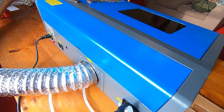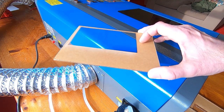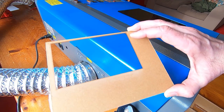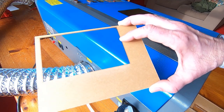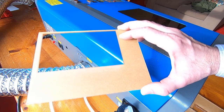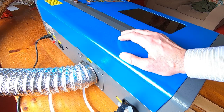They are quite useful if you want to cut plastics — though it has to be something cuttable by laser, as a lot of plastics will just catch fire and generate smoke rather than cutting properly. Something like acrylic cuts extremely well, giving a very nice neat cut. The laser beam itself is very small — about half a millimeter in diameter — so you can get very crisp cuts. You can also engrave with it depending on how you set it up and the power level. Overall quite an interesting machine, and if you've got space for one they're quite interesting to play with.